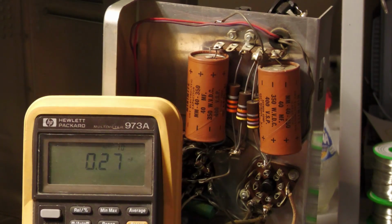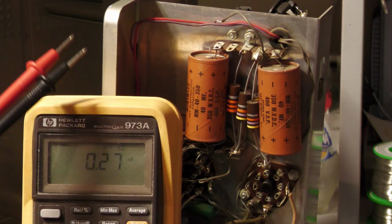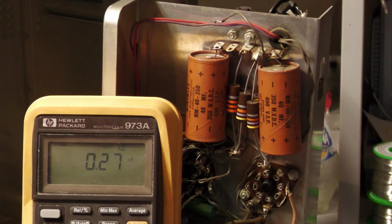And this is actually a strong indication that we have a leaky capacitor here. Okay, because the way this multimeter tests the capacitor, and how many other test devices for checking capacitors do it, is that the multimeter tries to charge the capacitor, and then it measures the time it takes for charging up the capacitor.